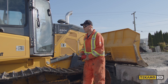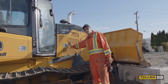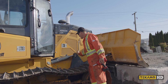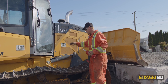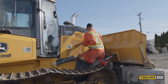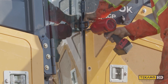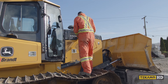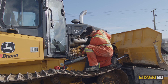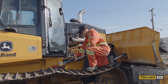To change the engine oil filter, the engine oil filter is in here, but we have the blade up so we can't open the door, and even if we could, we still couldn't quite get the engine oil filter out. So we're going to pop this panel off — this whole panel — and then this lower one as well. We'll start with the top panel; it's a 16 millimeter bolt. We have to remove the lower panel because the engine oil filter is tucked a little bit behind it, but since this panel goes up and behind the upper one, we remove the upper one first.